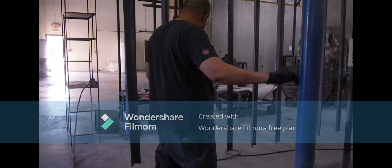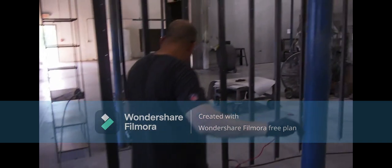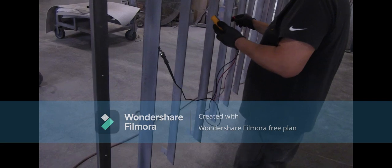3. An ohm meter will be used before the part is powdered to ensure that the part is appropriately grounded. Ohm meters measure resistance. For now, there is not a specific range of resistance we are looking for, simply that the ohm meter is registering that there is a path. There may be further problem solving that needs to happen, but these three things will aid in knowing what part of the chain needs to be addressed.